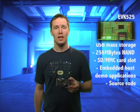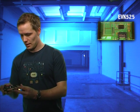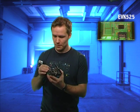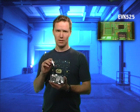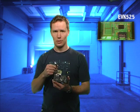The EVK525 package includes software that demonstrates the on-the-go possibilities of the AT90 USB parts so they can work as embedded hosts. If I just power up this board and connect it into an external USB memory, the demo application lets me copy a file from the onboard NAND flash to this USB pen drive that I just connected by pushing this joystick right here. It can move data between two USB flash disks or between one of the local storages and an external USB disk.